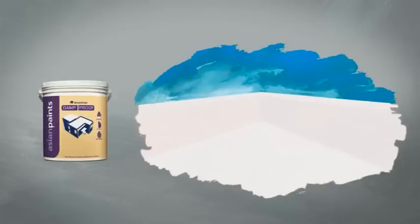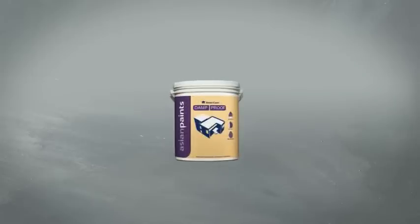While damp proof provides excellent resistance to wear and tear caused by normal foot traffic, sometimes there is a need to withstand heavier abrasion on a terrace. For such terraces, the following application should be followed to get an accessible terrace. Damp proof is first applied as per the standard application process and is then allowed to cure for 10 to 14 days.